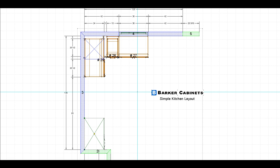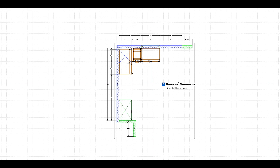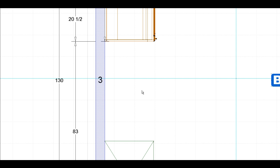Alright, so what I'm going to do is space it off of the wall by 1 inch. So I'm going to basically say, look, I need an air border of 1 inch from this to the wall. And it just slides in. You want to make sure that you're off the wall. And then at least another inch when you go into your cabinets. Now keep in mind that your countertop typically overhangs your cabinets by 1 inch. So nothing can go into that space. So basically, let's just kind of move on, and I'll be grabbing that. When we put the cabinet there, I'll show you how the countertop interferes with the refrigerator if you're not careful.